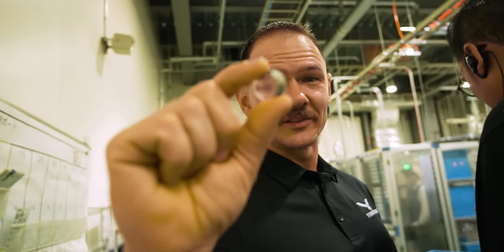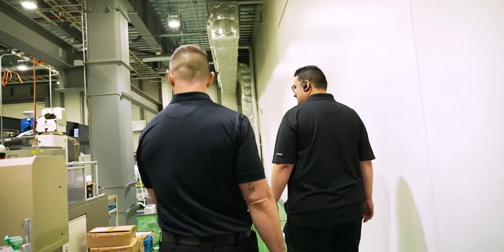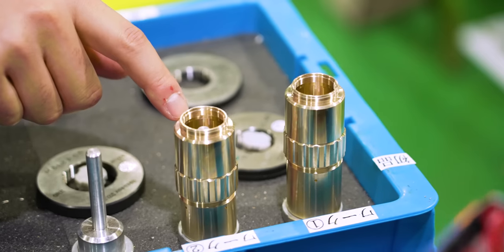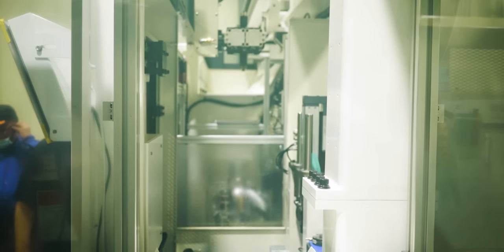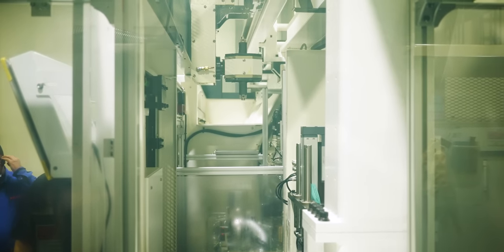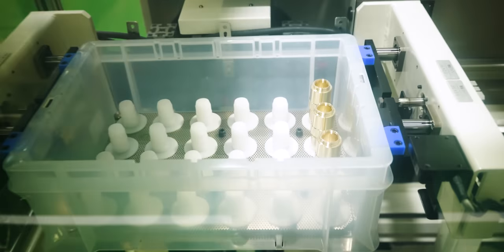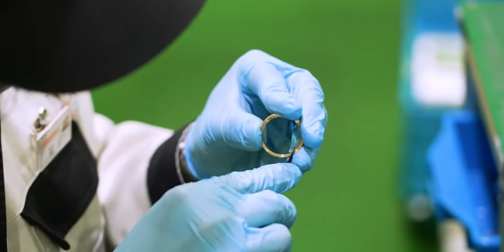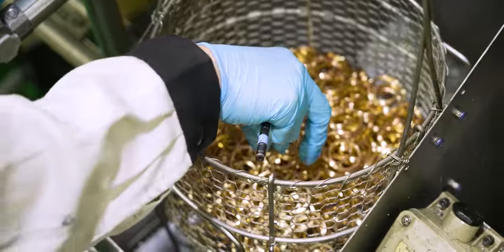I have a finished polished lens here. Moving next door, they're actually manufacturing the lens bodies and the different VMU components that hold the lenses. They have a machine that completely makes the bodies for the lenses out of brass — from the first op to the second op to actually loading it in a little compartment. The more hands it touches throughout that process, the more you introduce the chance for error. Here they're taking that out so they can just continue to run parts day and night, machines running nonstop on automatic, with another person deburring the finished product.